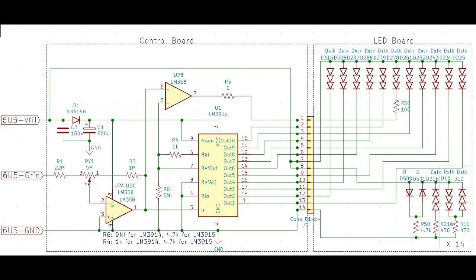Here's a schematic of the solid state tube replacement. On the left are the connections that go off to your radio — it just needs three connections: a filament voltage and the connection which would originally go to the grid of the 6U5, which is usually the AVC voltage. That goes into a fairly simple circuit consisting of a dual op-amp to adjust the range of voltages to be appropriate for the bar graph generator, and the bar graph generator itself.